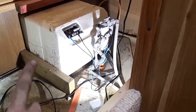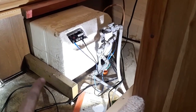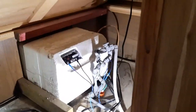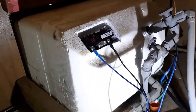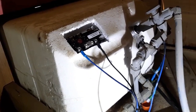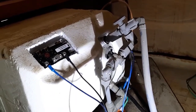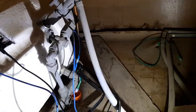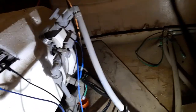You guys ended up missing a couple of steps - I apologize, my camera had died and I didn't notice until after I had the electrical hooked up. Anyway, it's actually very simple. The two wires from the heating element are color-coded black tip and white tip. From there you run one of the blue wires from the thermostat to one of the red wires on the heating element. The black wire coming off goes into the power source, and from the power source your switch runs out to your plug.